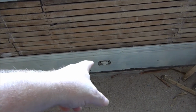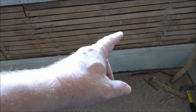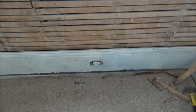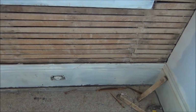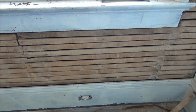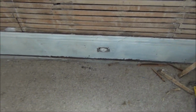Now the electrical, they got one electrical outlet, which is another thing wrong with this house. And the plumbing to drain it is going to have to go downstairs. So I'm going to have to rip open the outside wall to run the plumbing downstairs. I'll show you that in a minute. But while I have that open, I'm going to run the electrical up the wall the way they have it. I'll show you outside how they did it a while back, which looks tacky, and I don't like it, so I'm gonna do it another way.